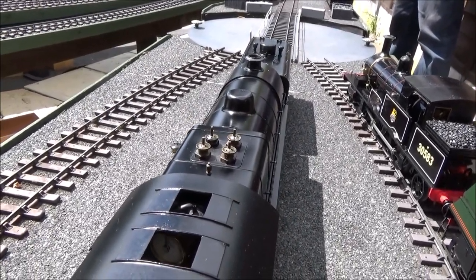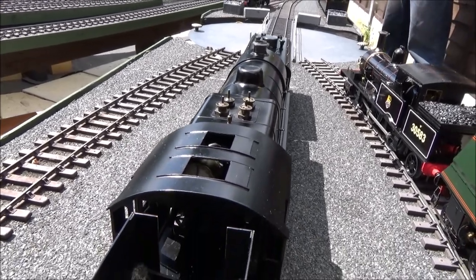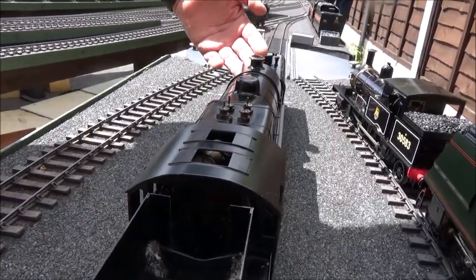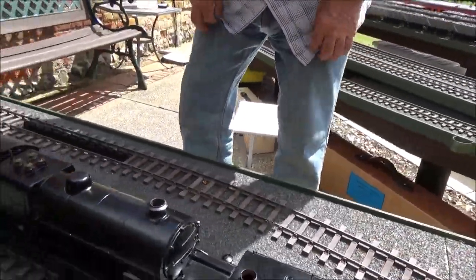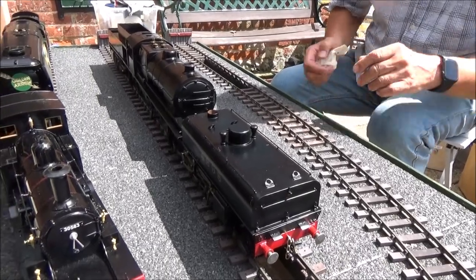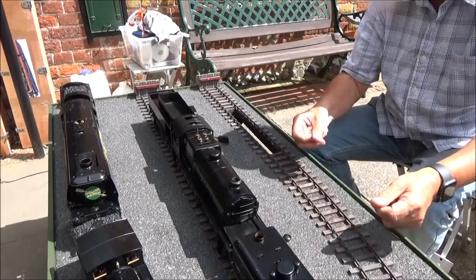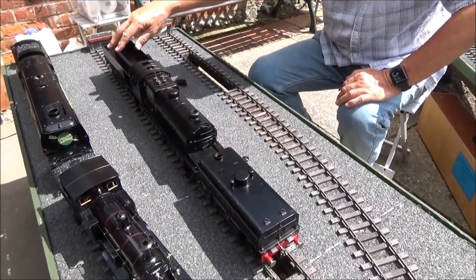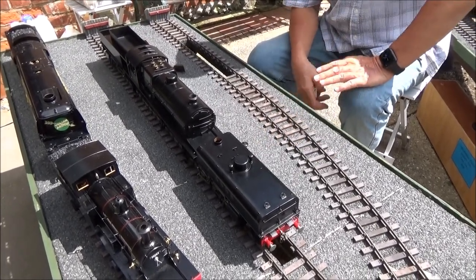and the big issue is with the cleaning, of course, particularly when you come to sweep the tubes, because you can't get the brush in easily. So these two tanks can be removed from the chassis really easily. I'll show you how to do that later. There are pins either side of each tank unit which withdraw, and then you can simply lift these off, because the little stub pipes engage with the chassis via O-rings. So it's quick and easy.